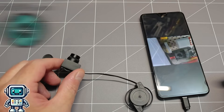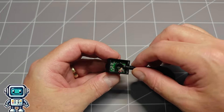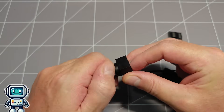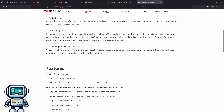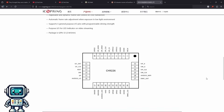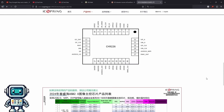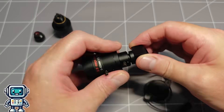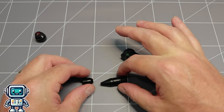First, we are going to remove the camera's electronics from its enclosure — that can be done by simply prizing the back panel off and then unscrewing the lens. Inside is a CH9226 CMOS image sensor chip. This isn't exactly a high-end solution, but it will give 1080p video at 30 frames per second, which is probably good enough for this application. This camera uses a standard 12mm lens mount, so we could even use one of our telephoto lenses or some simple microscope optics, as they all share the same mounting thread.